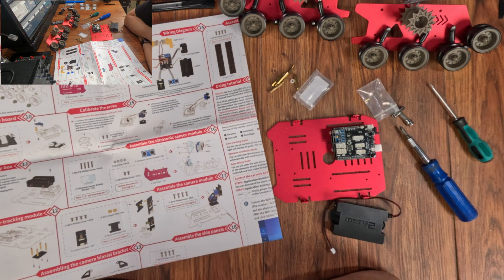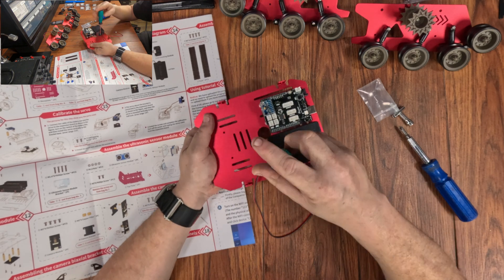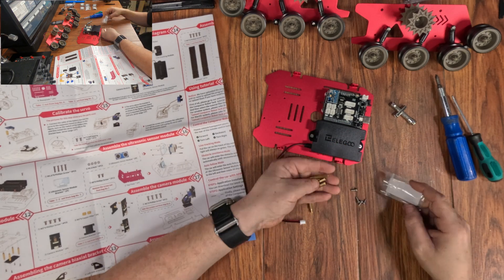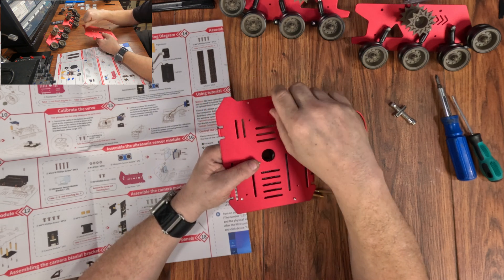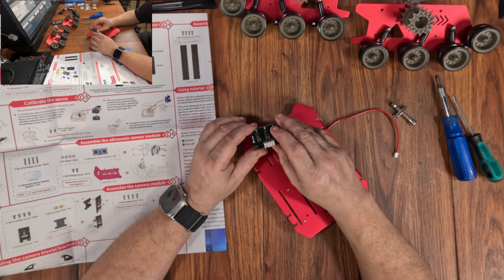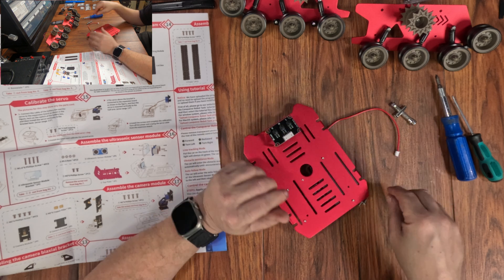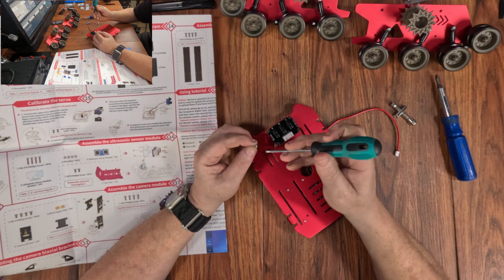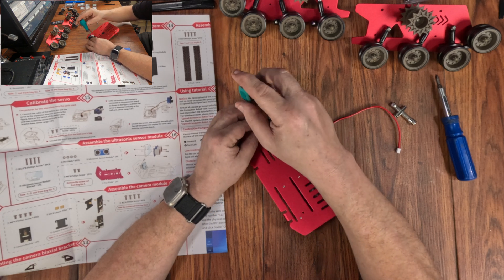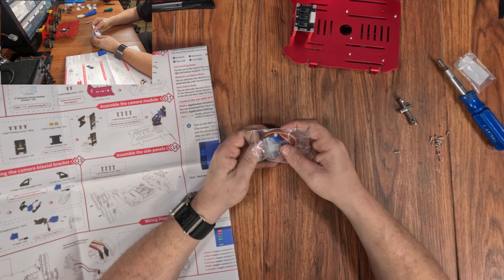Steps 11 and 12: the battery box and a line tracking board. The battery box is secured with two screws. As for the line tracking chip — I'm going to go out on a limb and say it tracks the black line on the mat. How it works: there are three sets of infrared LEDs with IR receivers pointed at the ground. The middle set looks for less reflected IR light, since black absorbs most infrared. As long as the left and right sets see reflected light, the Arduino knows the tank is on the right path. It mounts with four screws and four standoffs.